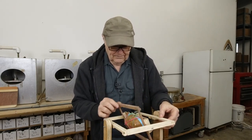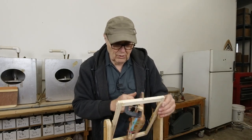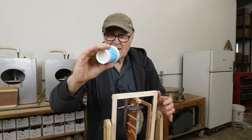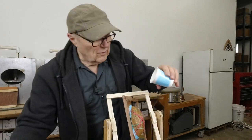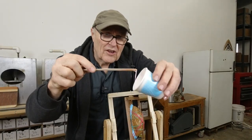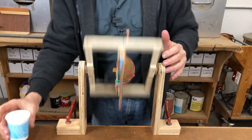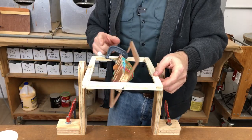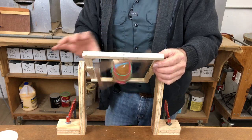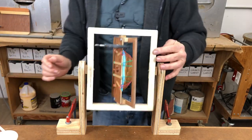It's a little more time consuming, but it works. I'm checking the witness cup to see if there's any sag going on. We're kind of at the gel state — it's not sagging much, but I'm going to keep it spinning to make sure, because it could sag. It can even do something worse, which is pull away from the walls of the rubber — we don't want that. So we're going to keep spinning it until I know we're not going to have any sag, and then we're going to throw in the last shot and let it cure.